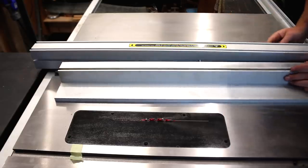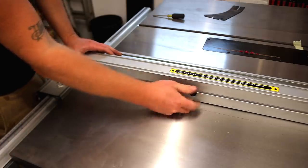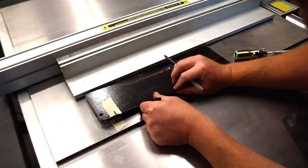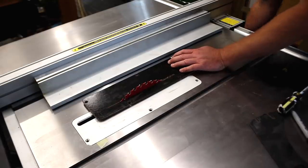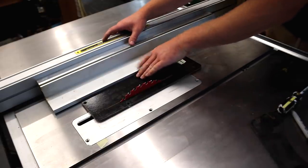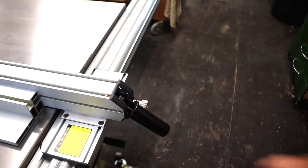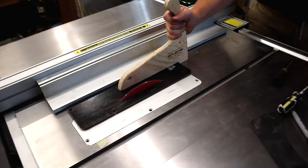I'm going to use the auxiliary fence that came with my saw to make the slot longer so that it fits over the riving knife. Before doing that I just want to transfer that pen mark I made earlier onto the plate itself. I then fit the original plate into the saw and, with the new plate rotated 180 degrees, I line up the fence so that the blade sits nicely in the kerf of the new plate. It was important to line this up really carefully as I don't want to cut the slot any wider than it already is. I lock the fence, then turn on the saw and cut the slot until it ends level with my pen mark.